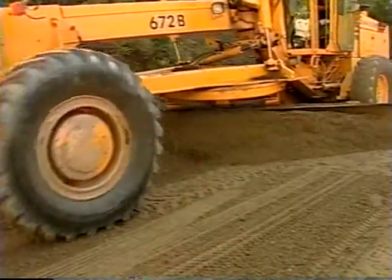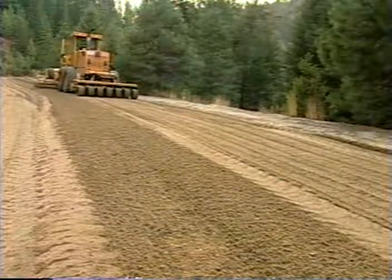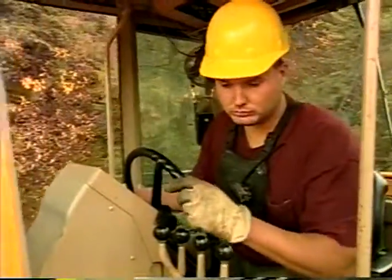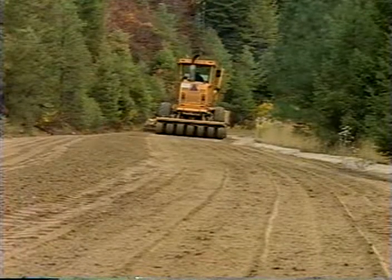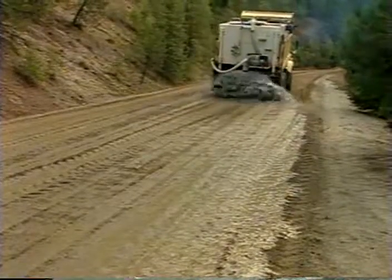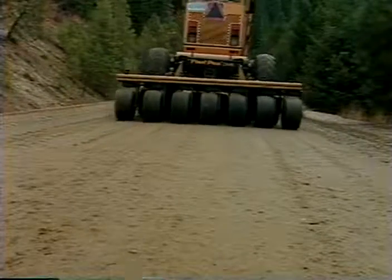Remember to keep your speed slow and steady to prevent the grader from hopping and to minimize irregularities. Spread the remaining windrow to the opposite side of the crown over the remaining traveled way. It's important to maintain the design width of the traveled way, being careful not to widen the road or lose surfacing over the side of the road. If you have excess surfacing, spread it on the roadway or place it in an area where it can later be reclaimed. Your work shouldn't leave any unplanned berms that might disrupt the road's drainage systems. When you've finished your last layout pass, water the surface. Compact the damp surface, including the shoulder. This will assist in bonding the fine particles to larger ones. A compacted surface will last longer and erode less than a non-compacted one.